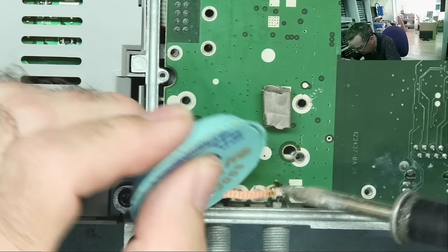Okay, you can see the pinout, standard pinout. So if this is an NPN transistor, which it says, you should see diode junction from here to here. Yeah, we do. Okay, so reads like an NPN transistor, probably is an NPN transistor, and it's probably okay. These both read the same as each other. Could be with those current diode things, probably okay. So what's this thing?